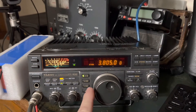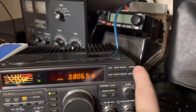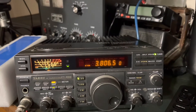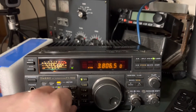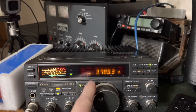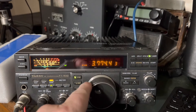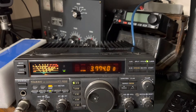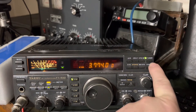I'm going to move off from where he is a little bit, turn the tuner on, and then you just press Start. It found a match that quick because I had already tuned near there. Let me move way down. You see that W light coming on — it's tracking me from pre-loaded memories. The memories that are in there now are from the old G5RV, so I'm going to let it retune.